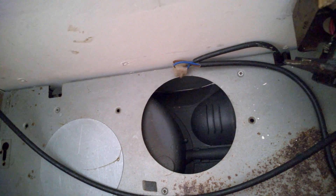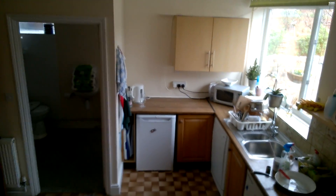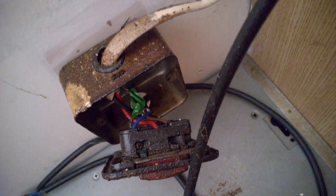It's supposed to be sealed, for one. And it's not the best place to put it — right above where the outlet is. This is unfortunately a recirculation-mode fan, so it doesn't vent outside. That will happen when we do a kitchen refit — we'll stick it on that wall and be able to vent straight out. But look — mains wire coming in, which is actually okay inside, but it's all left open to the grease and absolutely covered. I need to strip all this out, strip the wiring back, and relocate the plug somewhere out of the way of the vent.